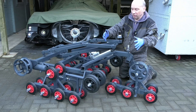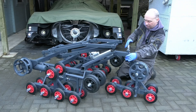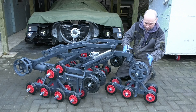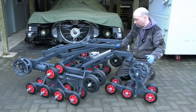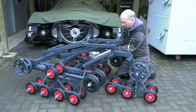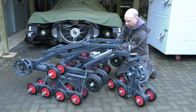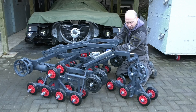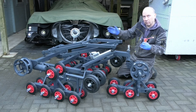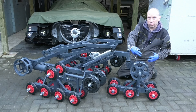We really don't know until the tracks go on, until we tension them up, until we put power through it — will they break, will they work? I don't know. The rear section has been put on as well and you can see it's now pivoted to the rear steering system. If I pop some power into the rear steering system you can see this working. Obviously this will be running at 24 volts — this is just a 12 volt battery so it's quite slow. You can see it steering one way and the other, and that will be linked in with the track turning.